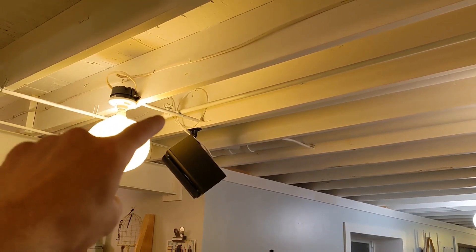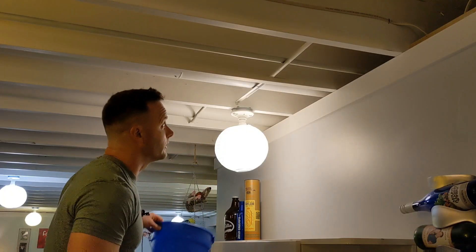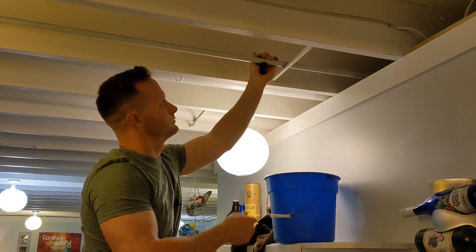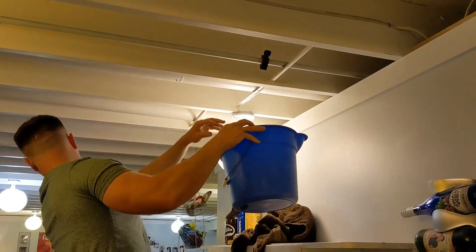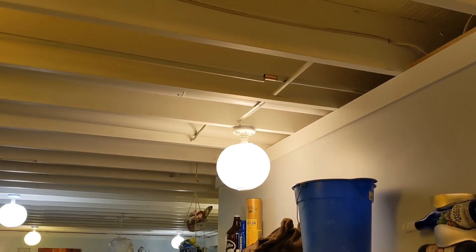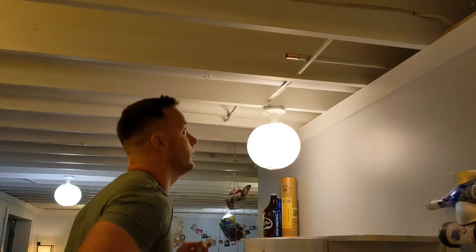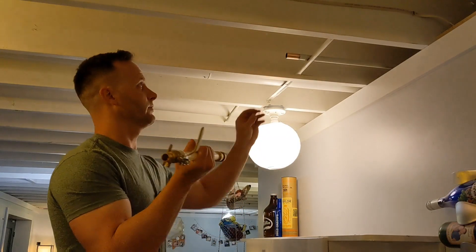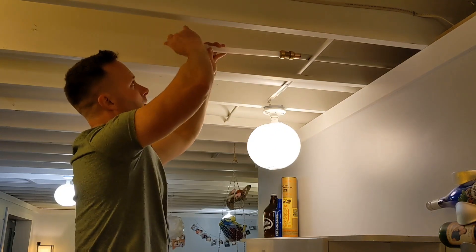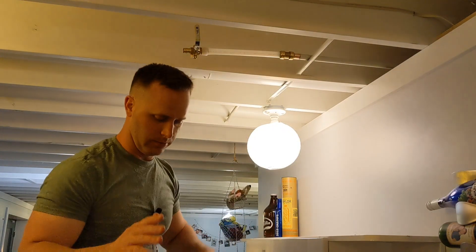Here is the valve that's malfunctioning and I'm going to cut it right to the left of it. I'm going to replace that with PEX-A. Let's cut this — I'm going to connect it right about there. We got that broken off, nice and clean. Now we got some clearance. Let's go ahead and shove this on — this is nice and clean. Beautiful. There we go. Open. Closed. That's closed. Let's turn the main valve back on.